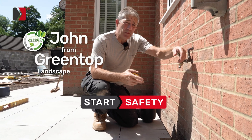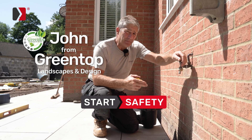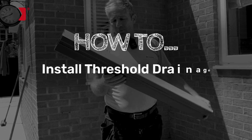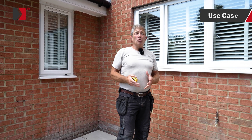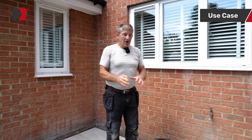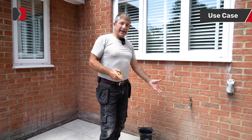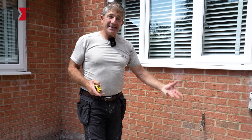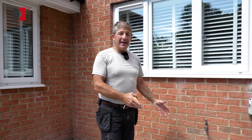Welcome to the channel. Today we are installing a threshold drainage system, and we found the perfect partner for this patio paving. We asked ourselves why we're installing a threshold drainage system on this small paved area. The reason is that before there was no back inlet gully, no drainage, no linear drainage system — just gravel that was getting contaminated with weeds and dirt. The threshold drainage system will allow us to get that water away.